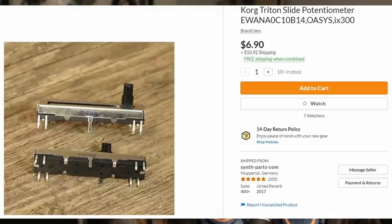That lets me know the faders are bad. That lets me know I need to replace them. It took kind of a lot of digging. I found exact replacements, and even though I'd only heard the issue in the master volume fader, I didn't check functionality of the sampling level or the mic volume. Since they were all reading out of spec and they were all the same part in almost the same place, it was worth it to me just to replace all three of them.